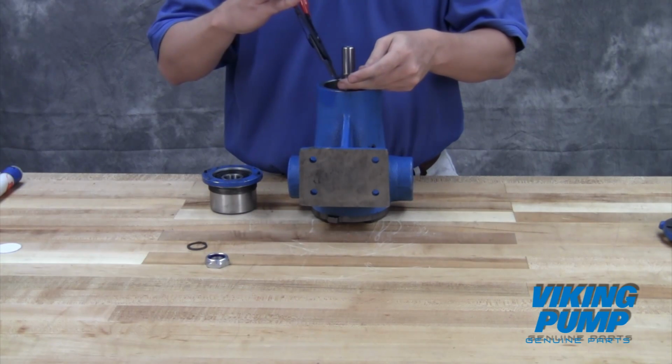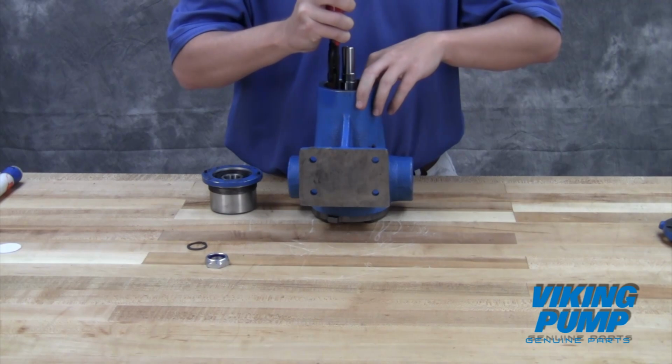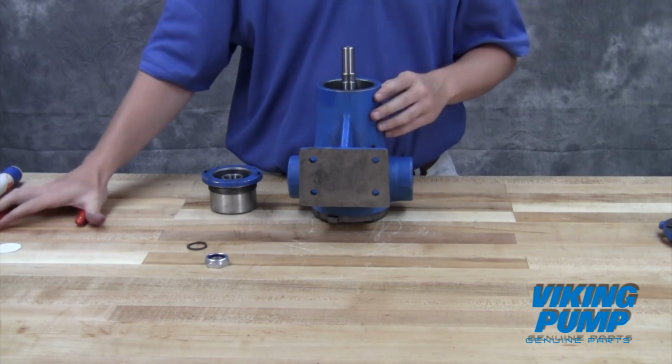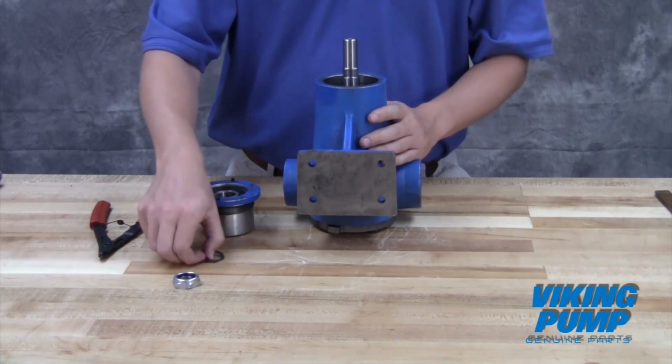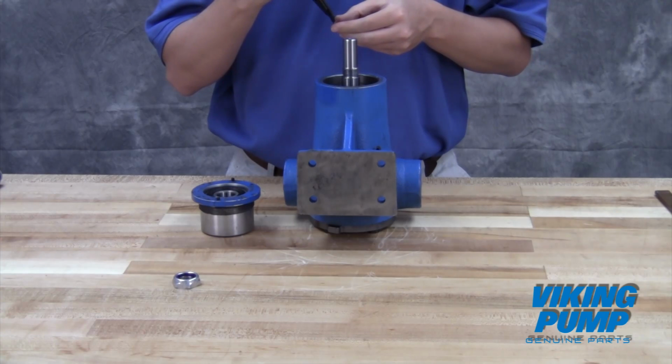Be sure to include the bearing retainer washer first on AS, AK, and AL models. No retaining ring is used on these models, but a bearing spacer collar will be installed next. Once all required retaining rings and spacers are installed, reinstall the outer bearing housing.